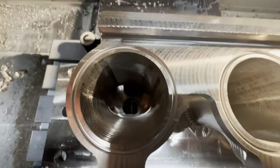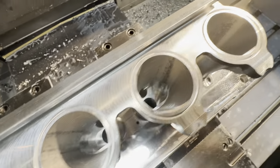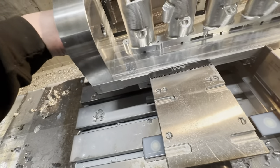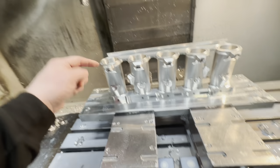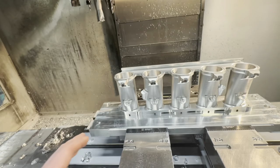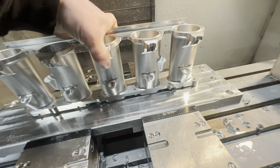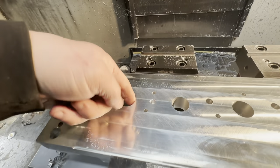Down there you can see the through holes which will allow coolant and swarf to drain out when we machine these pockets. The end pieces will go back on — for example that one will go back on its pins. So we're getting somewhere. If the dowel pins line up then the bolt holes are bound to be lined up as well, so this side is done. I'll flip it over now, clock off one of the bores — the counterbore is just clearance so if something's slightly out it won't matter — then I'll counterbore all the other holes so the cap heads sit nicely in the plate.